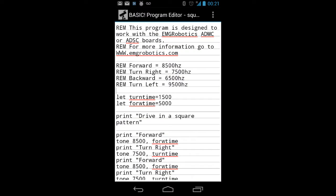The servo controller board is controlled via audio tones. You only need one audio channel, either left or right, to control two servos. The audio tones can be generated by any application that runs on the device. Pictured is RFO Basic, a free Basic interpreter that you can run on your Android device to generate the tones required to control the servos.